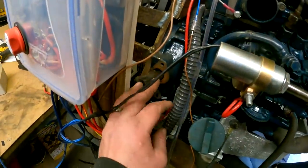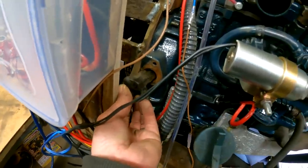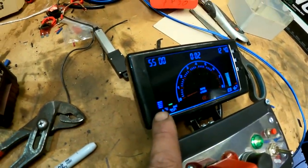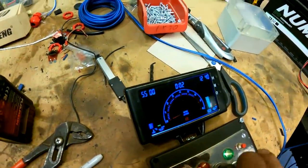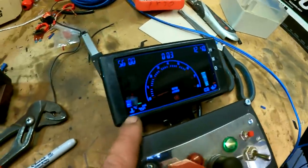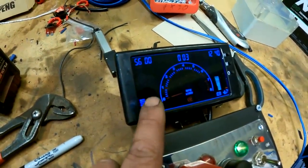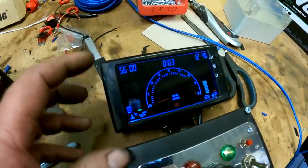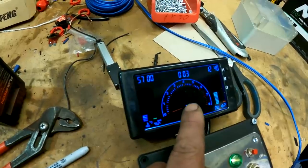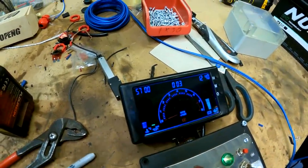So now we need to make a proper mount for the crank sensor. We're now starting to register cooling temperature which is good. The oil temperature input isn't linked up because I'm going to use that for the raw water. Oil pressure isn't working — the sender's good, but there's a problem. Maybe it only works when it's got an RPM signal, and we haven't got the RPM sensor wired up yet, so hopefully they correlate.